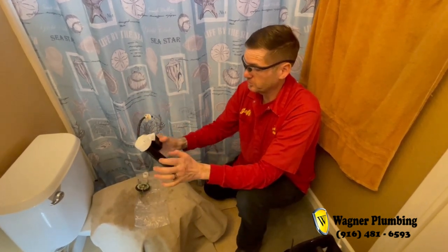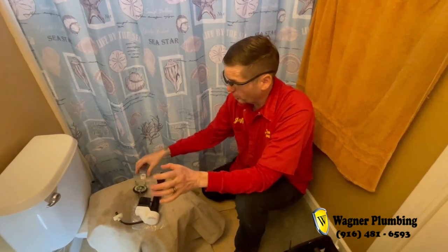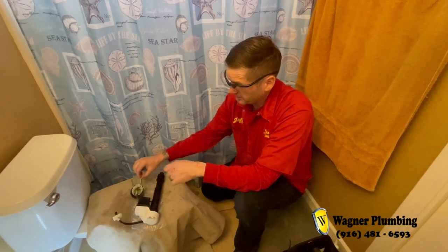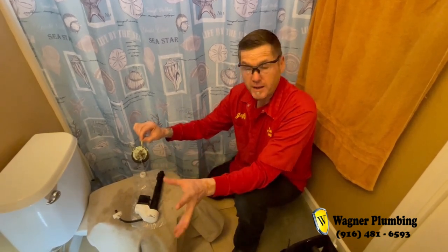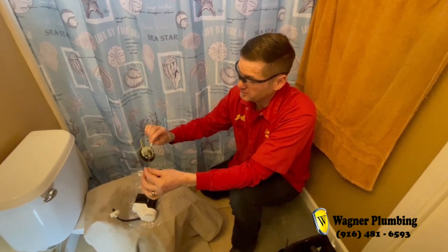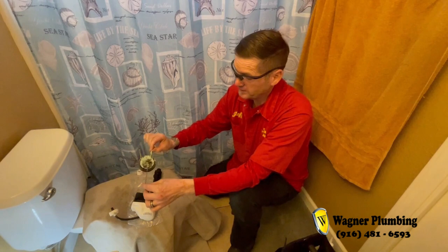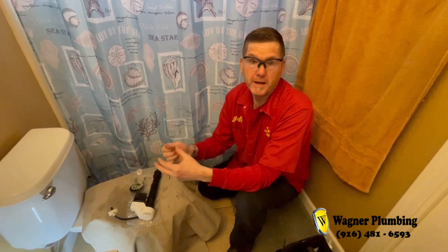The float piece was not working and it was stuck in a closed position. But always when we change or repair this piece, we also change the flapper. They come in all different sizes and colors and shapes, but this flapper, as you can see by the discoloration, was once a nice blue color and it is worn — the rubber is deteriorated. So we replaced that with a new one, and supposedly the new ones are made of a harder material that should last a little longer.